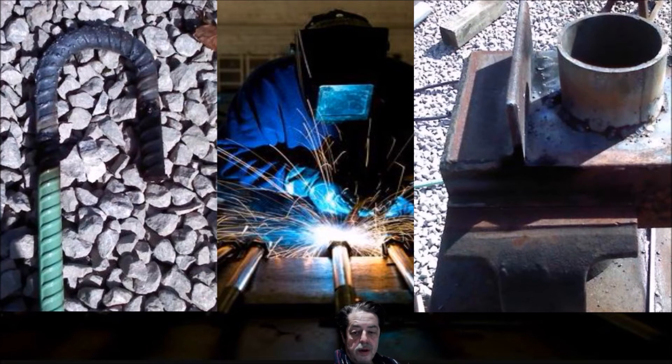I create the gap enough to accommodate both of those. For the quarter inch, I have another one where I've got it fairly tight. You have to play around and figure out for yourself how you want to tweak these — make them to your own design. You can make them bigger if you want to; I haven't had a need. I make them about the size you see because I like to set them right into my vice, tighten it down real good, and I'm ready to go. I bend my metal, and when I'm done I just loosen the vice and take the little jig back out and put it on the welding cart. You can use vice grips or all different kinds of things — you can create these your own way.